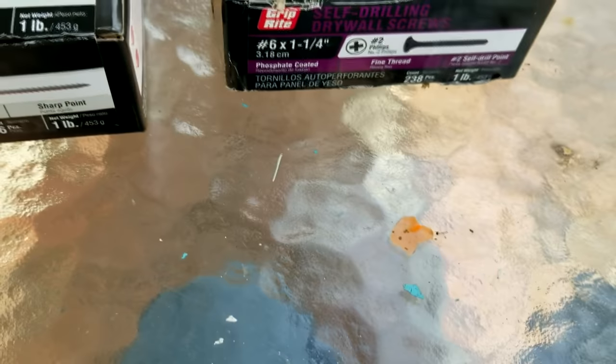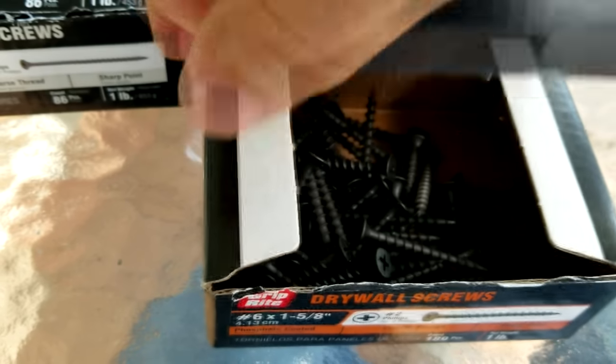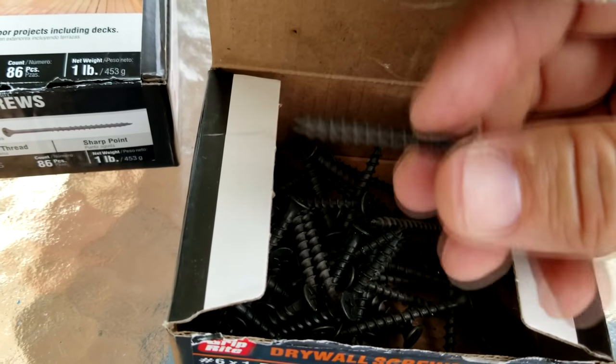This is another one that is not appropriate — your regular drywall screw. I've seen lots of guys use drywall screws and that's why they end up with a gap between the two cabinets. Take a look at this picture with the big gap — is this how you want your two cabinets to line up? Or do you want it to look like this, with just a nice hairline crack and no big ugly space in between?